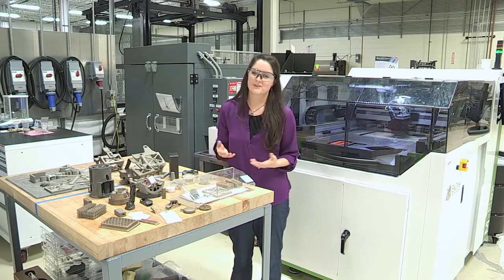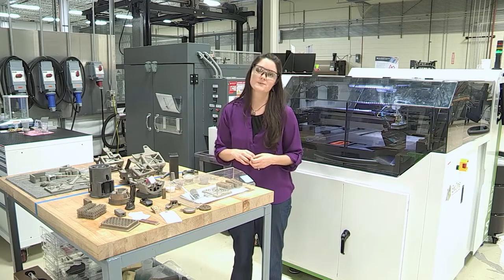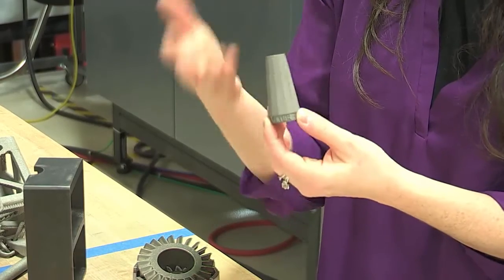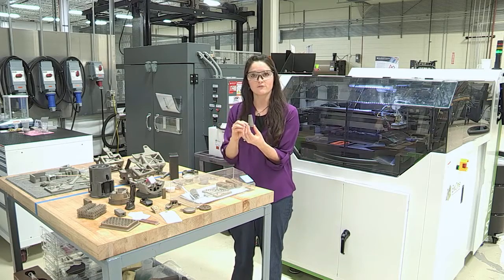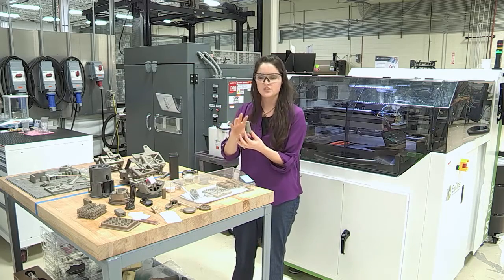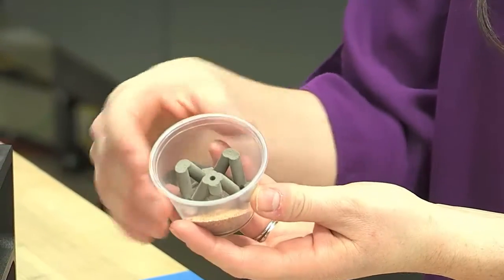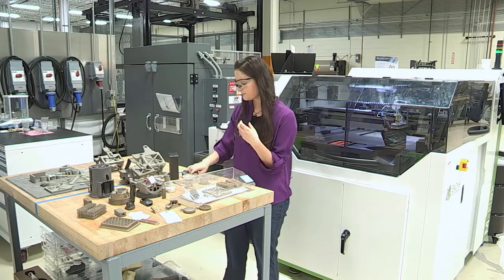So glued-together metal powder is not useful on its own. The last process we have is sintering. We heat the print up to its sintering temperature — that's when the particles are hot enough to stick but they don't flow; we're not melting. Then we get a part that's about 60% dense because of the packing factor of the particles. We are working on getting single alloy materials that are fully dense. If we do want a fully dense metal structure, we can put some bronze in the furnace process, and that bronze will melt at a lower temperature and wick up into the part using capillary forces. When it's done, it'll be 100% dense, just like this part here.